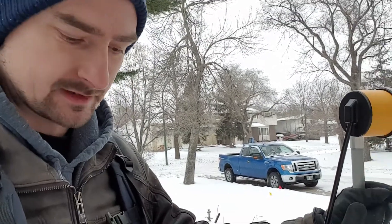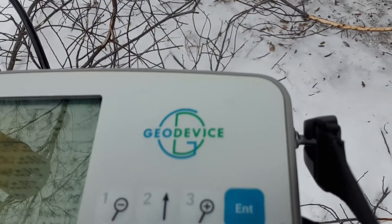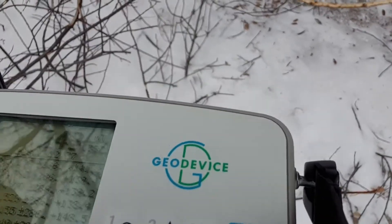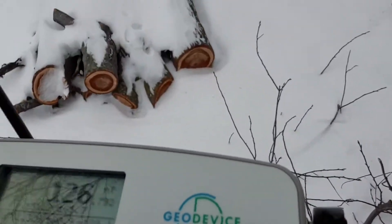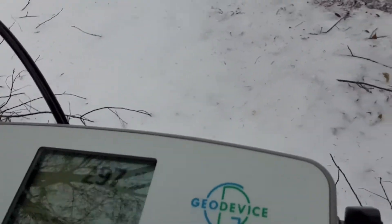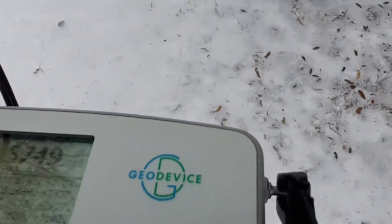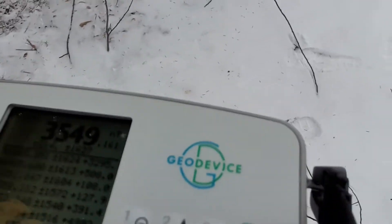Here I am in a quiet area of my yard where the gradiometer is further away from rebar and everything that is in my garage. If we can see the screen — it is hard to see — the top number is the magnetic gradient between the two sensors and it is a reasonable number. I have a water shutoff valve that we will try to detect. Right here is my water shutoff valve and the gradient is very high. Move away from it and it goes back down to something low. So this is the device performing as expected.